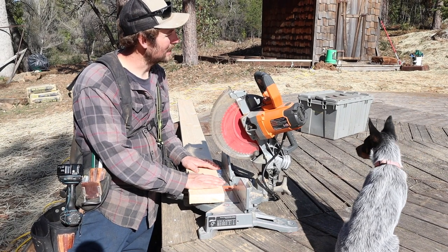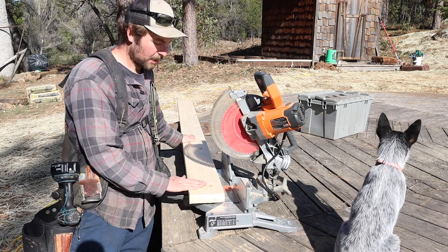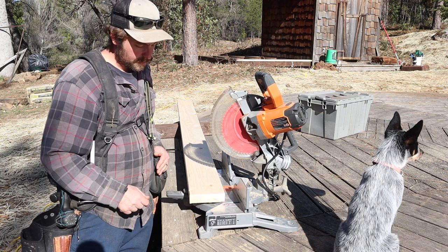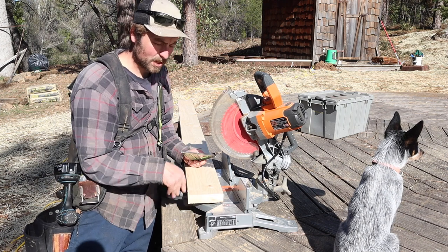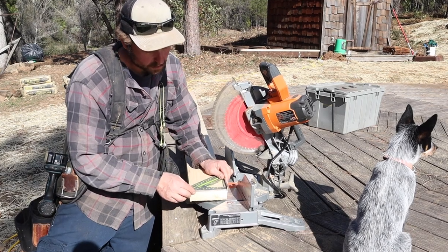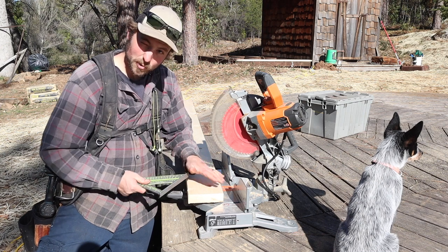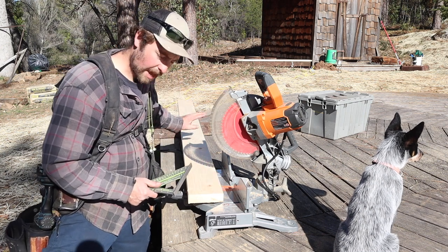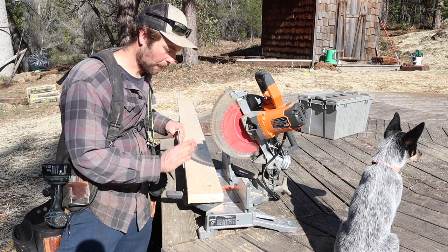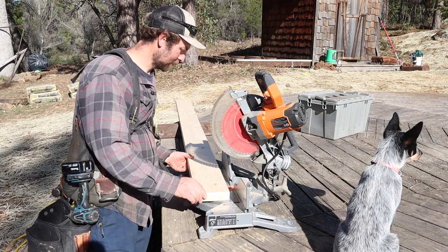Massey, relax. What we're using here for decking is 2x6 cedar. This is a pretty blonde cedar, not your western red, but it looks pretty good. With a lot of decking materials, they're not gonna have a square edge on them, so this one's about 1/8 inch out, so it's good to just square it out. On the other end, I'll leave that and cut it when I finish them all, and that'll give it a nice, good straight edge. So, let's cut one edge square and go from there.